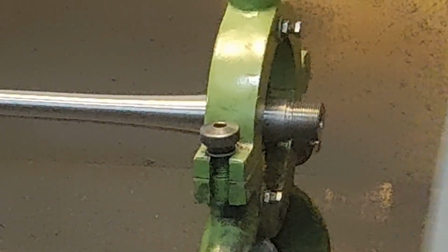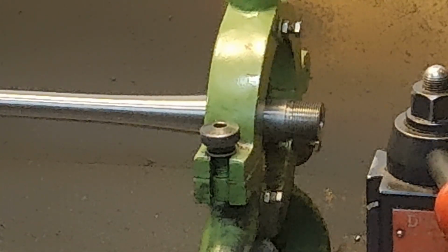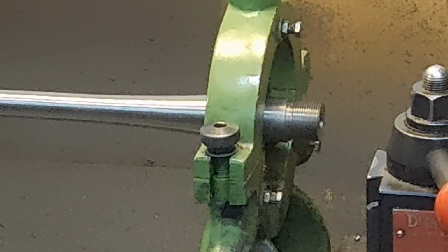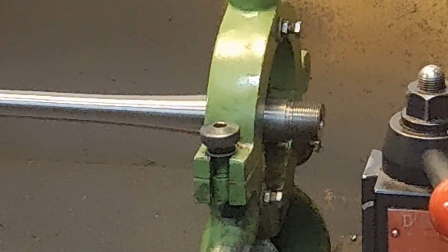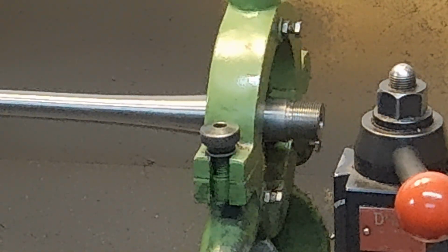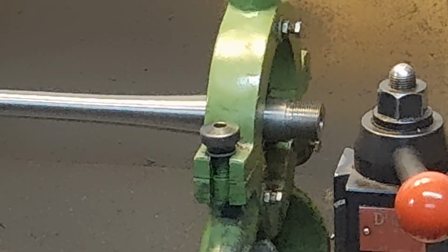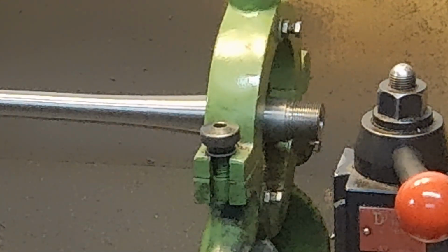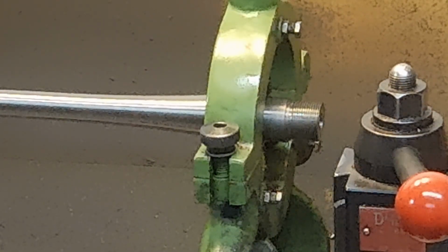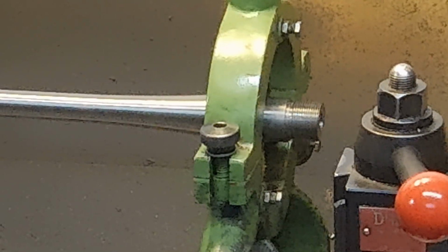As I said, back in the day when possibly you couldn't operate through the headstock, and as I said, just for expedience, because it's faster. So now we've got that hole roughed. And the only thing that remains is for me to find where I put, there it is, the dead center. I'll put that back in place and put the wrench on the reamer, and we'll get started on that part.